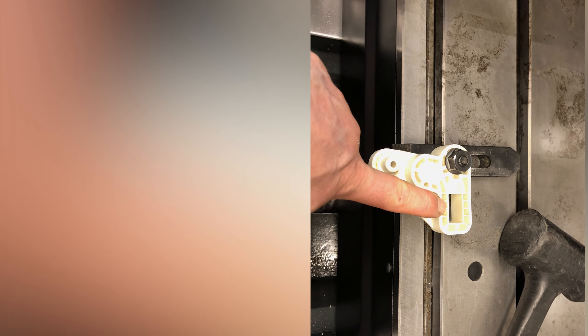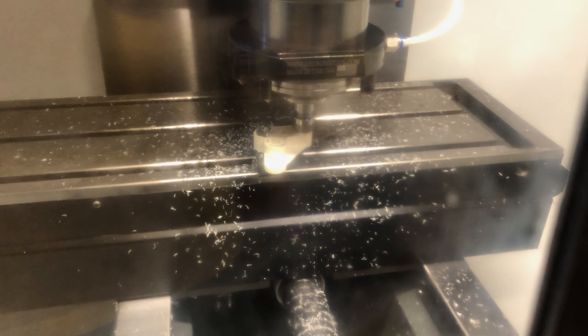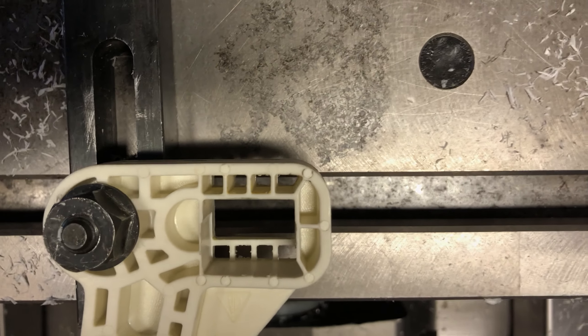Digging into this clearance issue further, you can see where this little ball end is really pushing in. There's a lot of wear right in here — there's actually a pretty good detent down in there, and if you look straight down you can see it's actually pushed down in. I've got this squared up in the mill. I'm going to cut back into this, get an aluminum piece glued in there, come back and square it up, and measure it out so that I've got a piece of flat nylon to put in there — nice and slick with the aluminum as a backer.